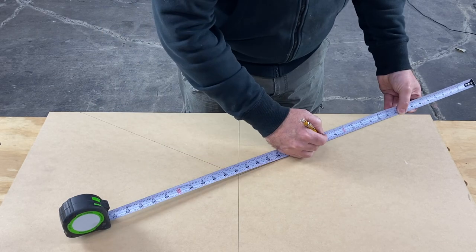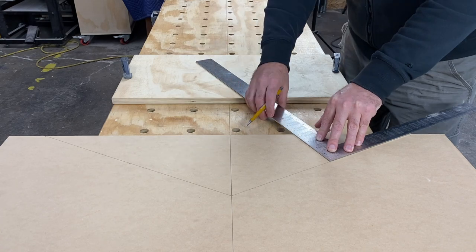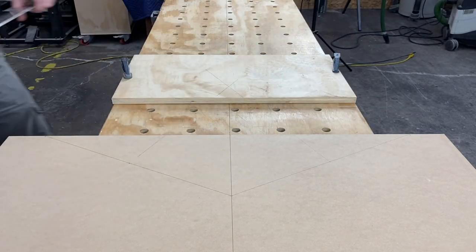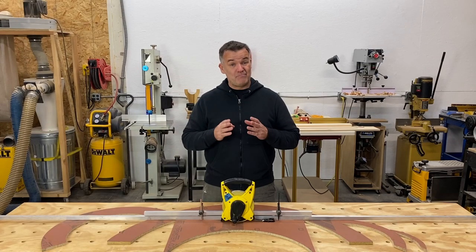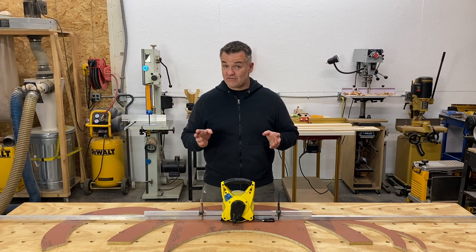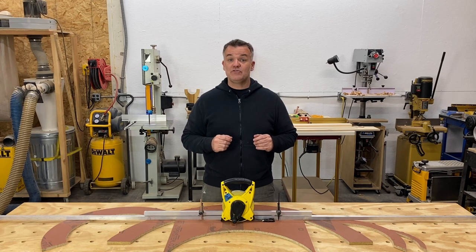Now find and mark the center of both diagonal lines. From these center points you can draw perpendicular lines that will intersect at the radius of the arc. You can probably see the bigger the arch, the harder it will become to draw accurately, and these steps are designed just to find the radius.